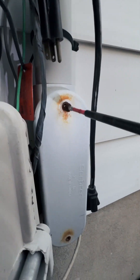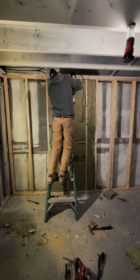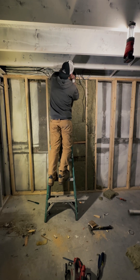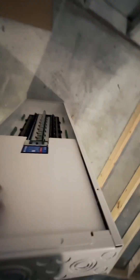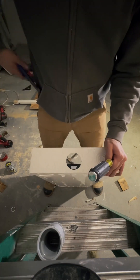We're gonna hop outside and take off the LB cover, then pull the wires out of the conduit. We're gonna try and pop out the end of the old conduit piece — there we go. And here's our new Eaton 200 amp panel. Back to some more smacking, knocking out enough for our two inch offset connector. Beautiful.